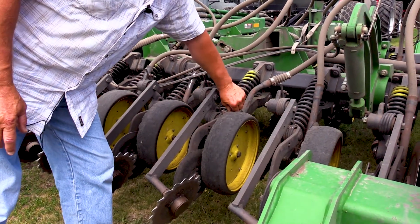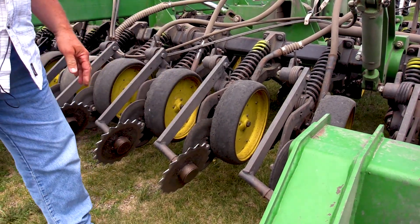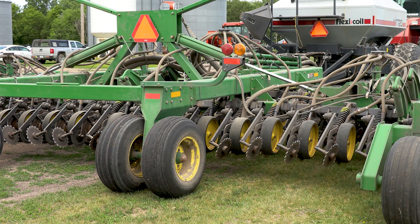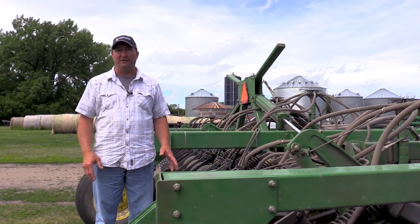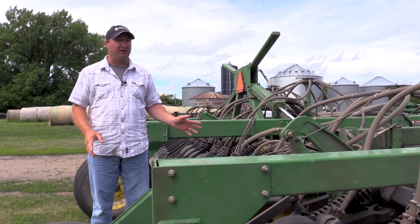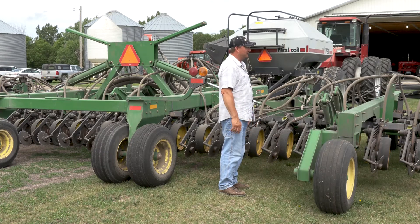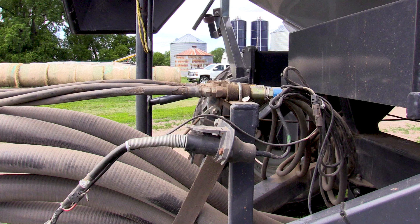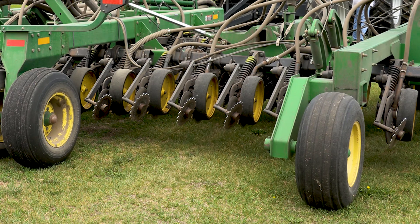This is the gauge wheel. This is the cutting disc and this is the furrow tube. This is the closing wheel from two different angles. This big disc and this whole setup runs at two degrees one direction and two degrees the other direction, which makes the seed furrow. This green apparatus is basically just the furrow opener in the drill that places the seed at the perfect depth, closes that furrow back up, and provides the best seed-to-soil contact. This is a no-till unit — it will seed into basically anything. It was designed with the down pressure and heavy-dutiness to be a no-till drill.